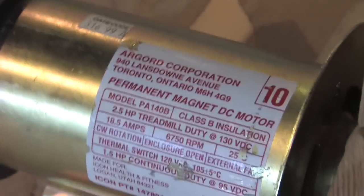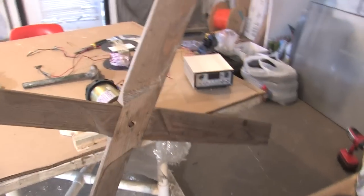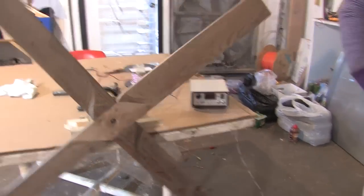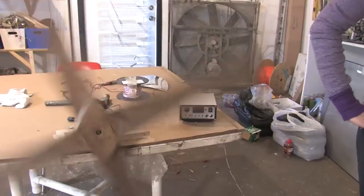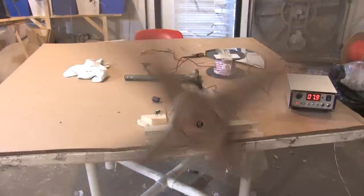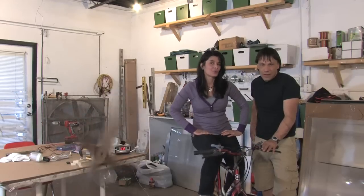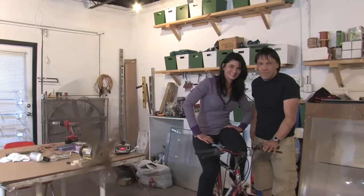We've got this motor hooked back up and you can see I have a four foot homemade turbine blade put on there. I'm going to have Denise start pedaling slowly — you can see she's generating the electrical current. You'll notice it has a little slip here and there as she tries to pick up speed. The reason it's having so much trouble is that we were getting about 600 to 700 RPMs out of this motor earlier, and we're not getting anywhere near that because of the large diameter of the blade. I'm your host Dan Rojas, and I'm Denise Rojas. Thank you for watching and enjoy our videos.